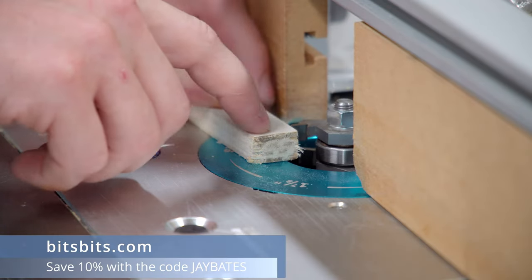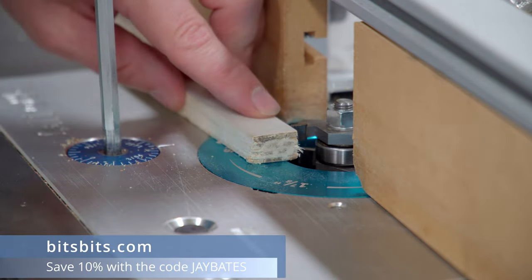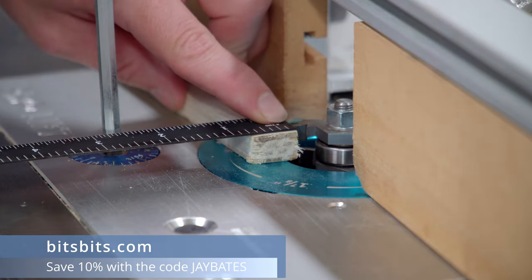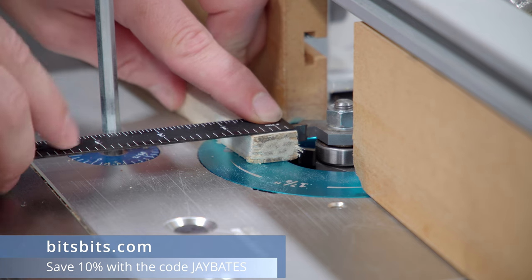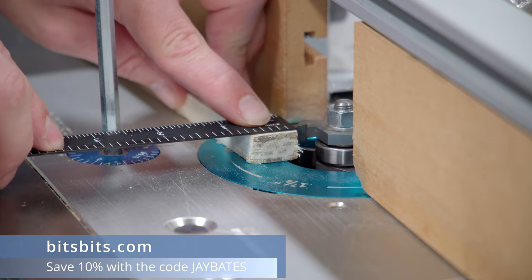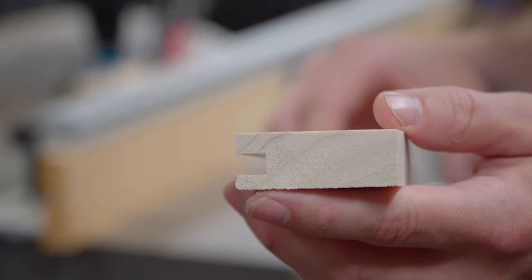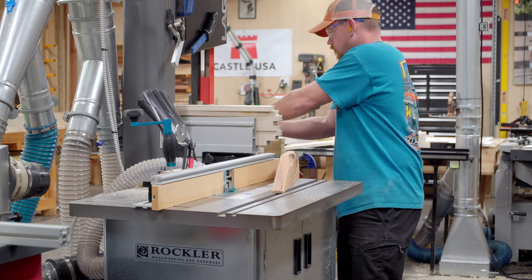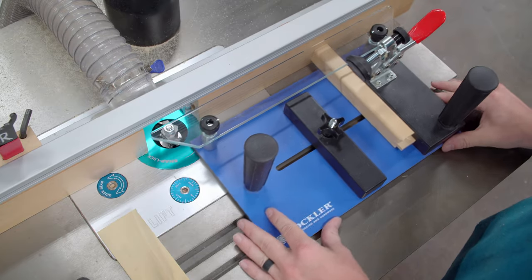For the drawer front and door joinery I'm using a tongue and groove bit in the router table — I'll have a link to this exact bit in the description. Normally you try to get these joints perfectly centered on the thickness, but in this case I wanted the top of the groove to be the same height as the thickness of half inch plywood, so I can cut a rabbet on the plywood and have the interior face of the plywood flush with the back of the door. A test groove is cut and you can see how much it ended up being off center — this is by design, the thicker part will be on the outside. I like what I see on the test piece so every one of the door parts gets a groove cut on the long side.